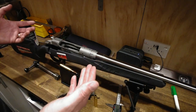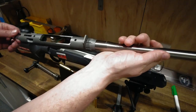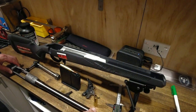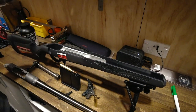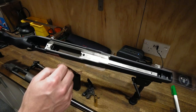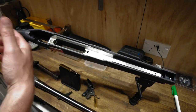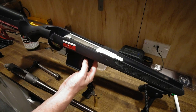There are a few things a little trickier than usual: the recoil lug on this older Savage action is actually a little bit too wide. I need to choose whether I shim down the recoil lug or reshape it, because the stock has this aluminium rail running right along through here — really stiff but lightweight. I have to decide whether to chamfer out the aluminium or reshape the recoil lug. Not sure yet, but this is going to be a really nice rifle.